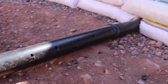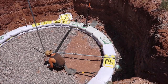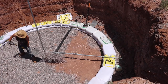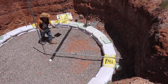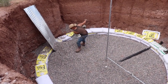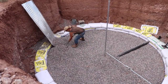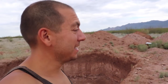I'm putting a three-inch cap over the pipe to stop gravel from getting into the end, and then spreading more gravel around the base of the interior of the root cellar. The ground is all covered but I'm not done yet — I have to put in enough gravel to cover that pipe and try to make it even to the first layer of bags. That'll make a nice, even, sturdy interior floor for the root cellar.